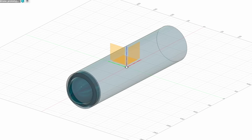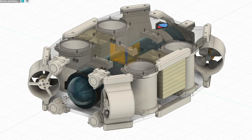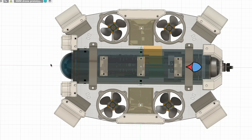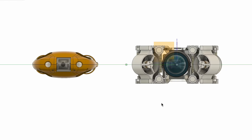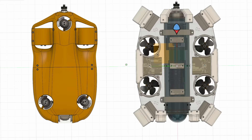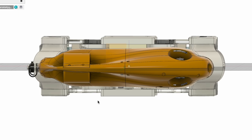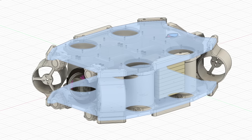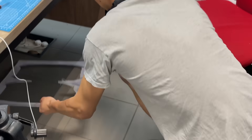After spending a couple of weeks in Fusion 360, this is the design I came up with. We still decided to go for the acrylic pipe in the body, similar to the CPS-5. The new drone is a little bit bigger than the old one and should have roughly twice the forward thrust since there are twice as many motors pointing in the forward direction. We intentionally made this design more blocky than the CPS-5 so I didn't have to spend months designing a hydrodynamic shape, and it also allowed me to CNC the frame out of polycarbonate, which should be much more sturdy than 3D prints.